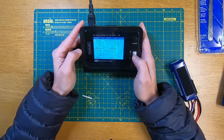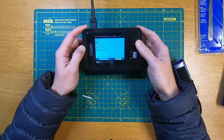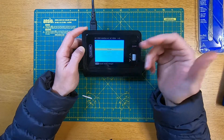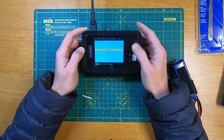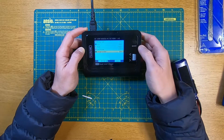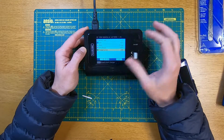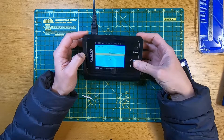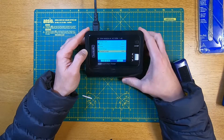If we go into channel one and press the jog wheel, we can choose the battery type, number of cells — just leave it on auto and it will detect those from the balance lead. Going down to mode, we've got the option to charge the battery or put it into storage charge. You can't really discharge directly, but if you select storage charge and the battery's still charged up, that will perform a discharge anyway. Select your end voltage, just leave that as default, and then there's the current. There is a limit when using AC input on how much current you can charge at. I'll set this to two amps, which is pretty standard for what I need.